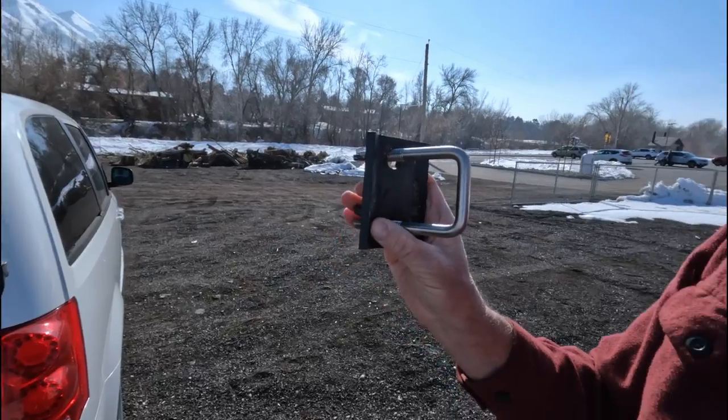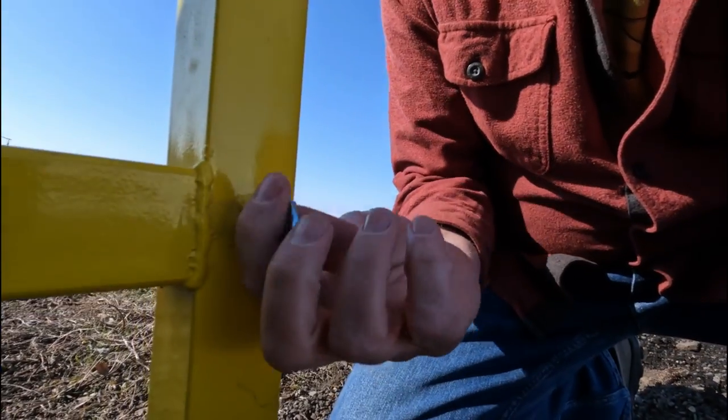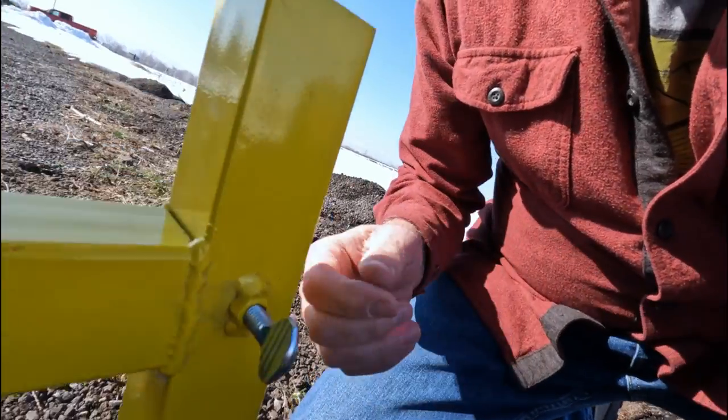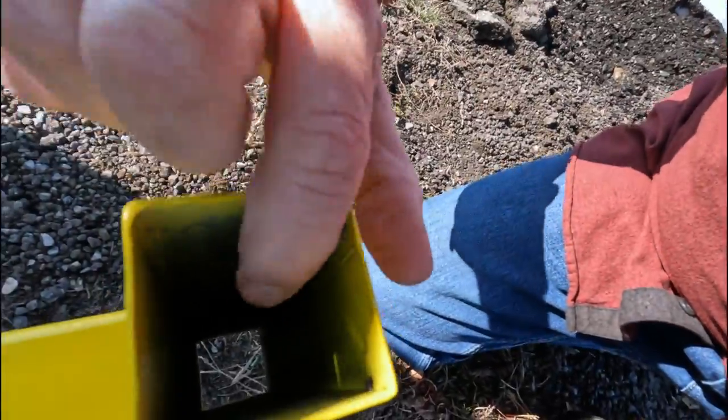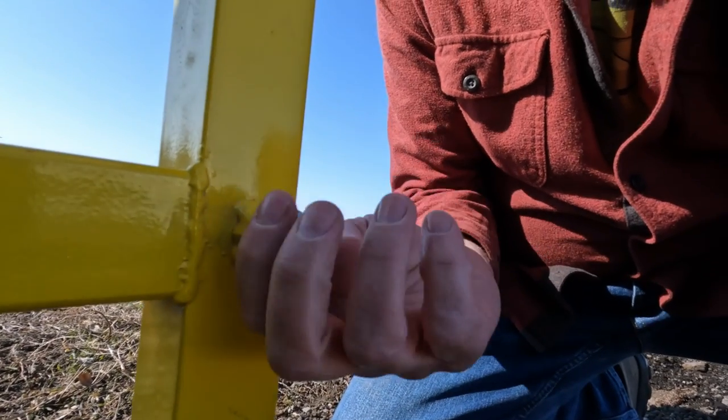This is an anti-rattle bracket, and I picked this up at Harbor Freight — link in the description. One of the features this mount has is a thumb screw to tighten down any mast you put in. This one is a 3/8-inch threaded thumb screw, and as you tighten that down, any mast you put in here is going to stay solid and keep it from spinning. You may or may not need that feature, but it's part of the mount.